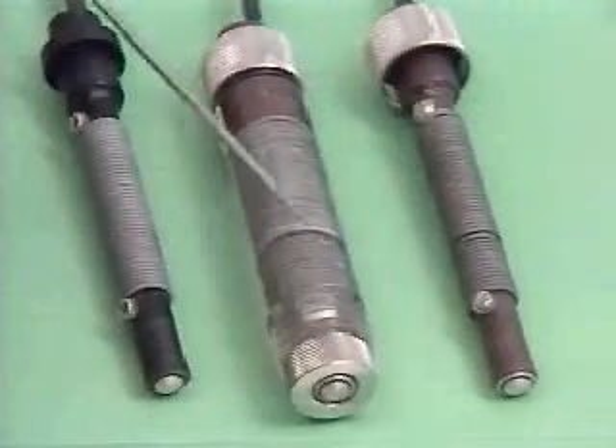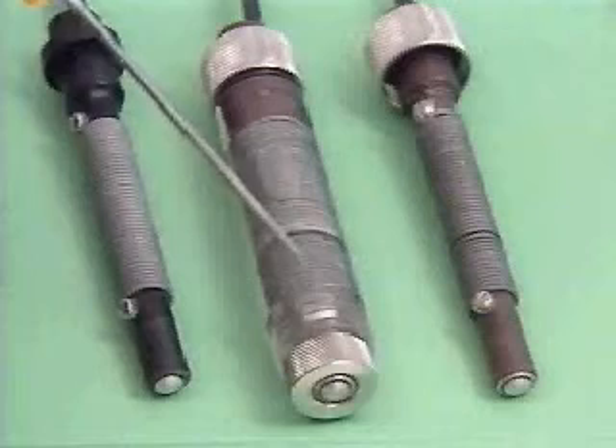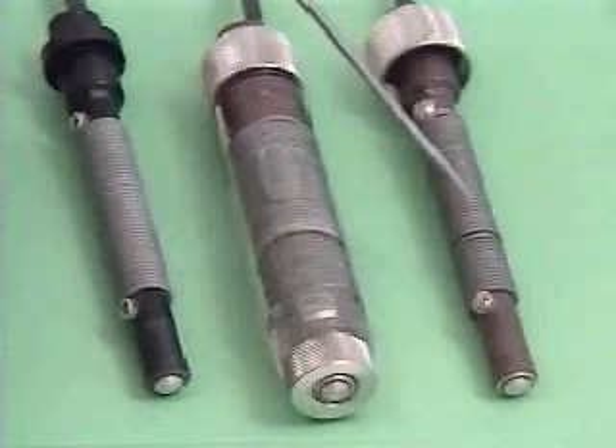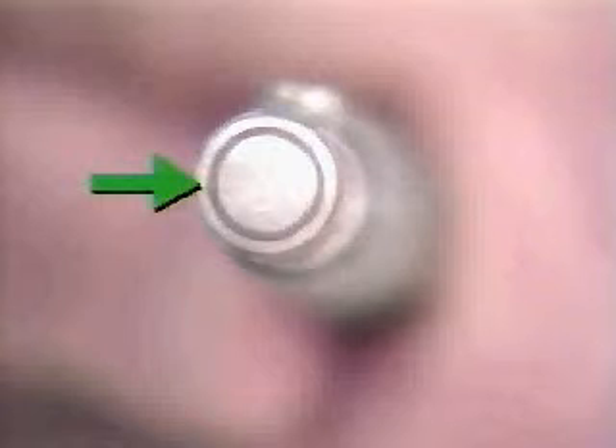This is the Model 94 sensor. The sensor is a galvanic cell which produces a voltage that is proportional to the rate at which oxygen diffuses through a Teflon membrane stretched across the face of the sensor. This is the interior of the Model 94 sensor, the assembly that we refer to in our literature as the probe body. At the end of the probe body, there are two platinum cathodes. The center platinum disc actually performs the oxygen measurement. The outer platinum ring helps to recondition the sensor electrolyte during our patented self-cleaning cycle, and it also serves to quicken the sensor's downscale response time when applying the sensor for use at very low oxygen levels.